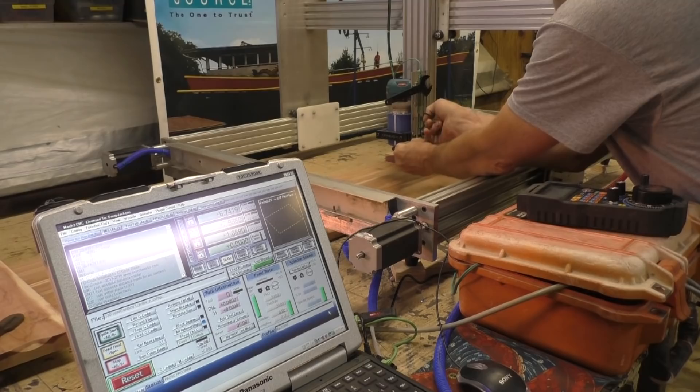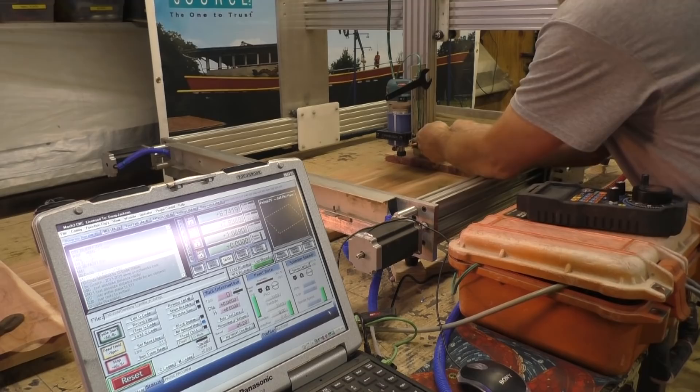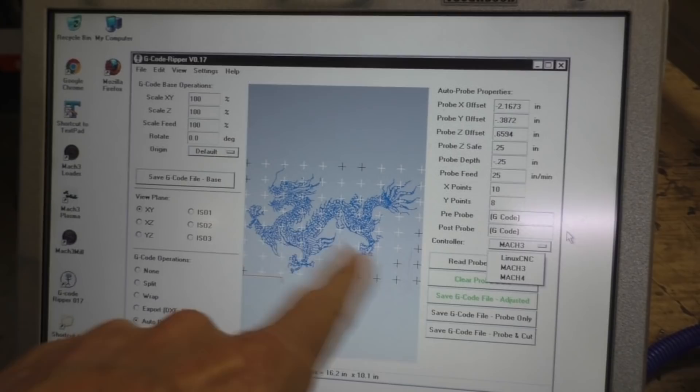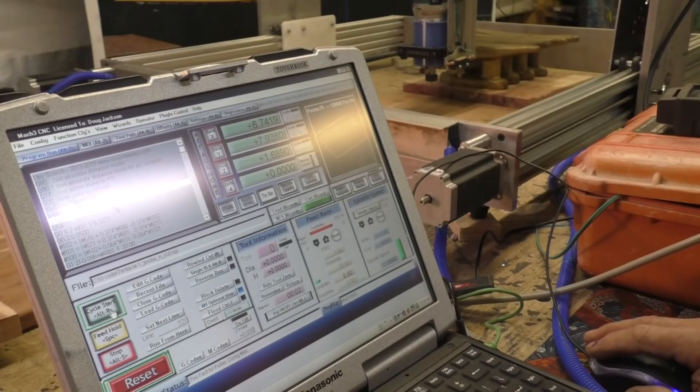We have little notches in the grooves here so that when we reposition the probe we can always put it back to the same location — that's important because there are offsets. It has to know how far it is from the cutting tip, and the notches let you always put it down at the same depth. With the probe done we can start a cut. If I piqued your interest about probing and you run Mach 3, Mach 4, or Linux CNC, the program to do that is free — it's called G-code Ripper and I highly recommend it. It's easy to use: you load your G-code, tell it what kind of grid you want under auto probe. How to hook up the probe is in our other video — a link to this and all the products we use are in the description.